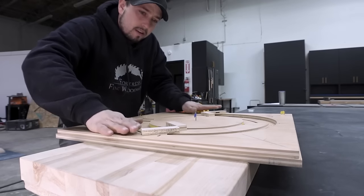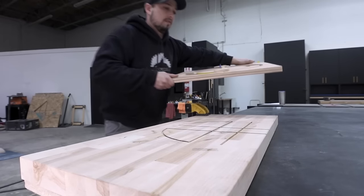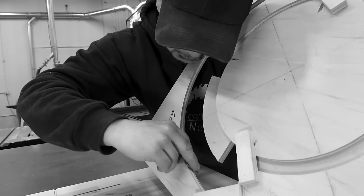We're about to move on where we actually test the cut, create purfling strips, and do inlays into the table. You might be saying: hey, you realize you don't even need the barrier — you can just double-sided tape the jig to the tabletop and you won't be wasting plywood. To that I say, you're right. And you're a little wrong too, because oftentimes when routing patterns, if you double-sided tape them, they can move a tiny bit. And what happens if you pull the template and forgot to cut one of the sections? You'll be in a world of hurt, because good luck getting that template back into its original position. And if you go to put your inlay in and realize the groove is a touch too tight, you can certainly alter your jig to make a correct fit, but you won't be able to position it accurately again.